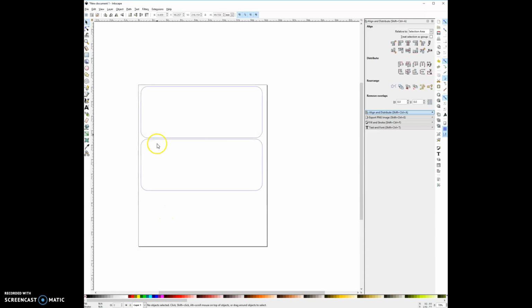I need to now cut the groove that's going to go in the middle that holds our light strip. The laser's going to cut any place it sees the blue here. And I want to talk a little bit about the colors that may come up here because I've got to make some adjustments. First off, this groove we're going to drop in actually needs to be a true rectangle with sharp corners. So I'm going to toggle down my little circle there.